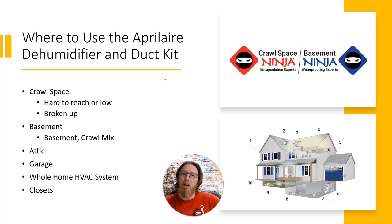You can put them in attics — actually cut holes in the drywall of the ceiling and push dry air in and out of your home that way. That's a very effective method, especially if you have a home that doesn't have a lot of space for a good-size dehumidifier. Just be careful in the attic: make sure you've got drip pans and water alarms installed in case of any condensation or leaks. Also garages — we see a lot of homes in East Tennessee and throughout the South where the HVAC system is in the garage. We had a home where bedrooms were built over the garage, so heat and moist air from the garage would go up into those rooms. Controlling the humidity in the garage is a great solution, and this ducting kit works well for connecting to adjacent basements or rooms.